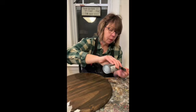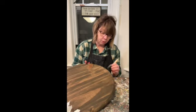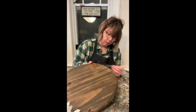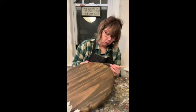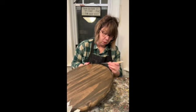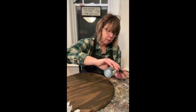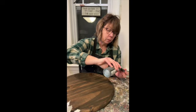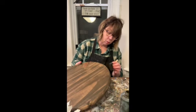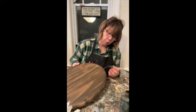Another thing you can do is a second coat. If when this dries it's not quite as dark as you wanted, that's okay — just do a whole second coat. You can do a second coat after about an hour since this is water-based. And it's going to go much darker, so just be prepared for that.